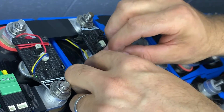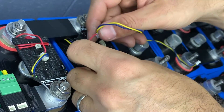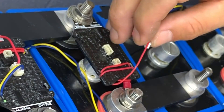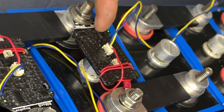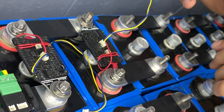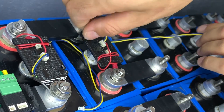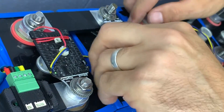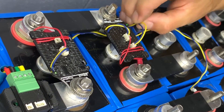We're routing the red cable underneath before finally plugging in the connector, making sure to support it as we go. You'll notice the LEDs blink as the unit powers up — both a red and a green come on briefly. The green then stays on for a longer period to confirm it's powered, and once communication starts the green LED will go off and just blink occasionally.